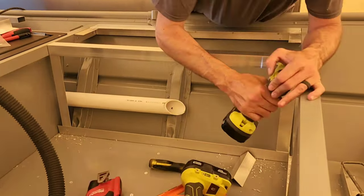For the decking, I'm using .090 sheet aluminum, and there's a variety of ways that I cut my shapes. Sometimes I measure, cut the part big, make adjustments, make some marks, and then I cut off the excess. For more complicated shapes, I'll make templates. The shapes for this boat were pretty simple, so no templates for the decking were needed. To cut the aluminum, I'll use my sheet metal shears or a circular saw, depending on the cut and the accuracy needed. For more precise fitting, I'll use a grinder with a paddle wheel to shave and finesse material for a jam-up jelly-type fitment.